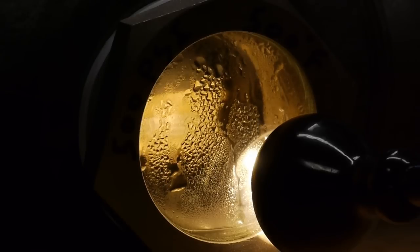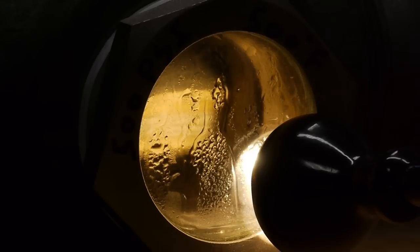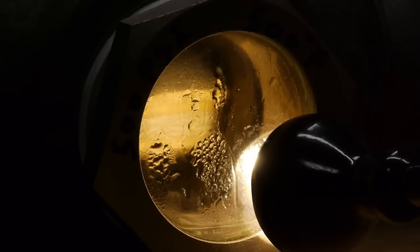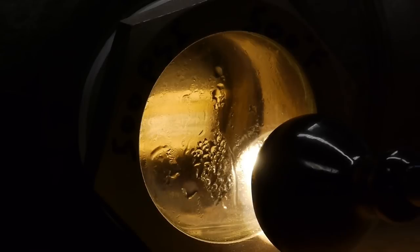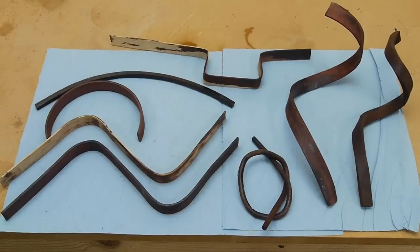This is actually ammonia I created in a previous video, and it's probably quite wet — there's probably a lot of water vapor mixed in with the ammonia. You can see as the gas flows into the chamber it's sort of raining inside, probably because the water is condensing on the walls. The pressure in the system will depend on the ambient temperature — the warmer it is, the higher the pressure in the ammonia bottle. If you need a little more pressure you can use a hot air gun to heat up the ammonia bottle, but it's still just gas flowing from the bottle to the chamber.